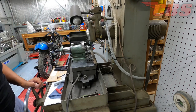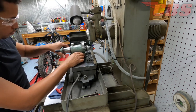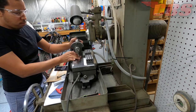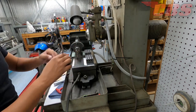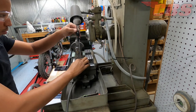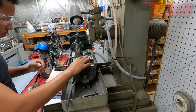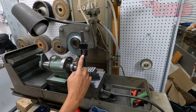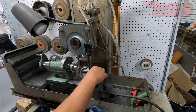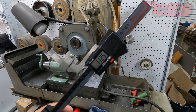All right, let's do our final check. The target is inch and an eighth — 1.125. As a reminder, if you guys have any Triumph or BSA cam followers with a quarter inch to three-eighths stem, I can do any radius from three-quarter to inch and an eighth for $20 a lifter. We're going to change the camera angle here and the height gauge says 1.125. So we'll get these packaged up and ship them back to the customer.